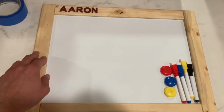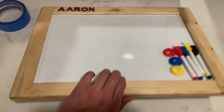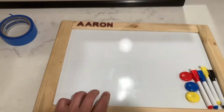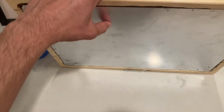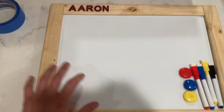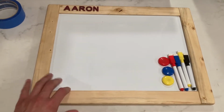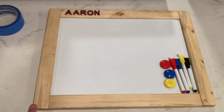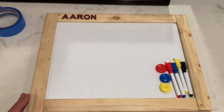And if I was gonna do this again, I think I would look for some whiteboards that were a little bit thinner, because this one that I got, the front is like sheet steel, I think, with corrugated cardboard in between, and the back is sheet steel as well. Some thinner, like masonite mounted whiteboards I think would be better, because I wouldn't have to route as deep of a channel. That was like the biggest pain of the whole thing, and the messiest and loudest and dirtiest. So I think if I could sidestep that would be even better.